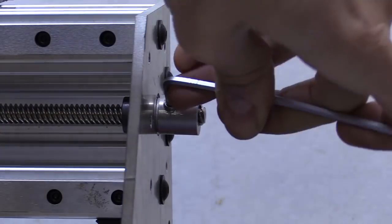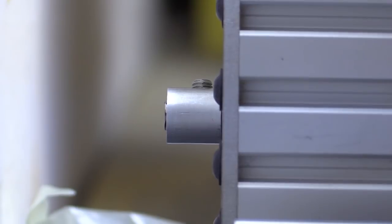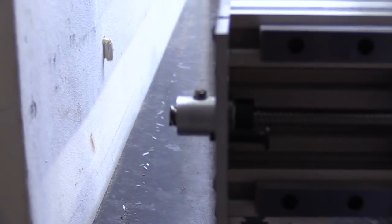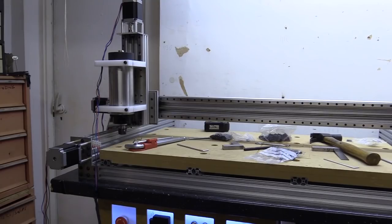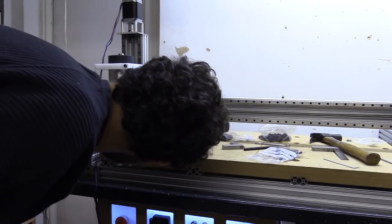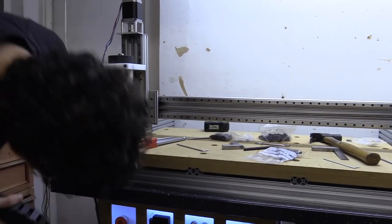I could also still install a drag chain where I intended, but this would reduce the overall width of the cutting capacity. So every time I get a step closer to finishing, I realise there's a ton more things I overlooked or new ideas I'd rather follow despite being halfway through realising the previous ones. But hopefully in the next video, which should be the final one, I'll just need to install the drag chains, fit the new limit switches, remove the old proximity sensor wiring from the controller, and then I can actually make something. Fancy that.